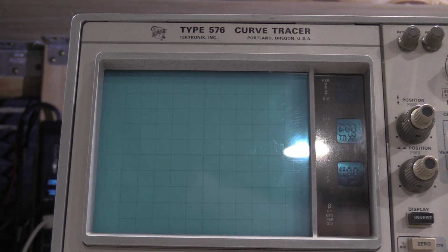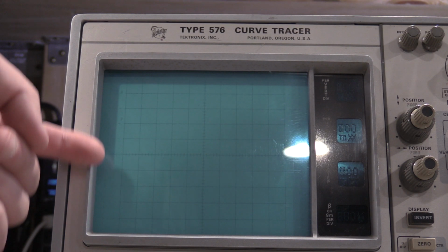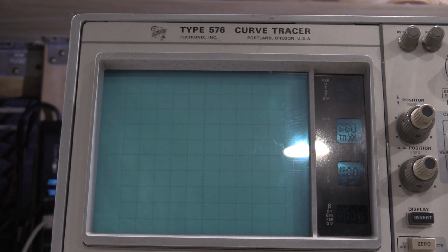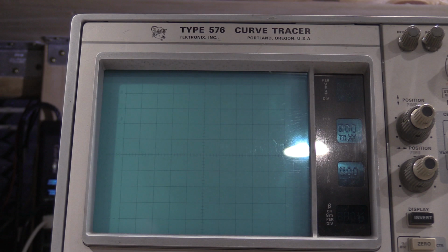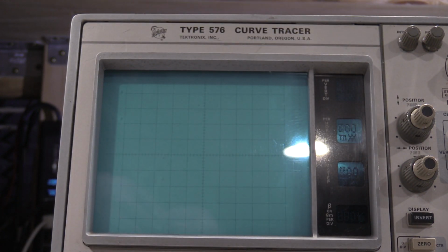One of the things they're checking for is when a tube is tired, it'll have a double ramp, so it'll get bright, dim out, and then get bright again. That's a tired tube. The cathode is worn out. There's an oxide layer preventing electrons from hitting the phosphor. So not much you can do. Sometimes you can rejuvenate a tube like that.